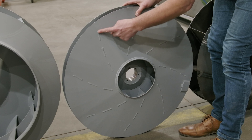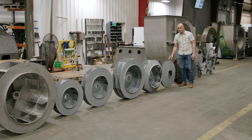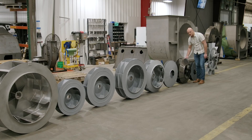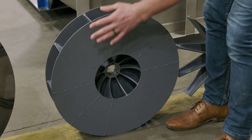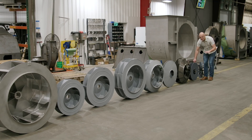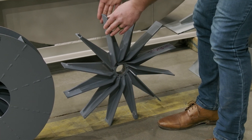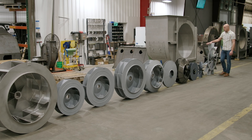Moving on, we have a backward curved pressure blower that can achieve up to 72–73% efficiency. Then the industrial exhaust air handler, which has a backward inclined blade and can achieve up to about 69% max static efficiency. Next is the HPSM, a shrouded radial pressure blower that achieves up to about 67% static efficiency. Finally, we have the open radial — a narrow open radial pressure blower — doing 63–64% static efficiency, and another open radial similar to it.